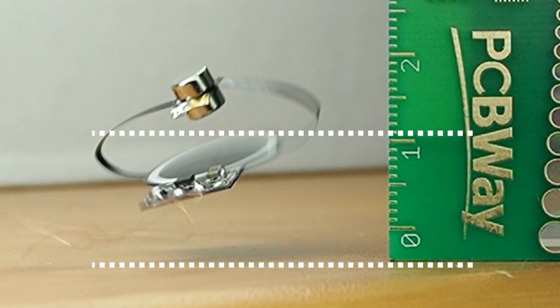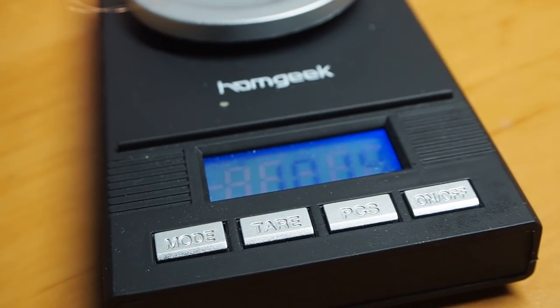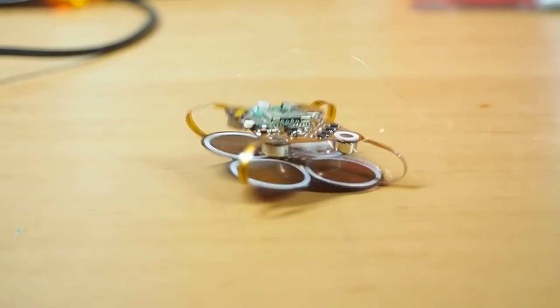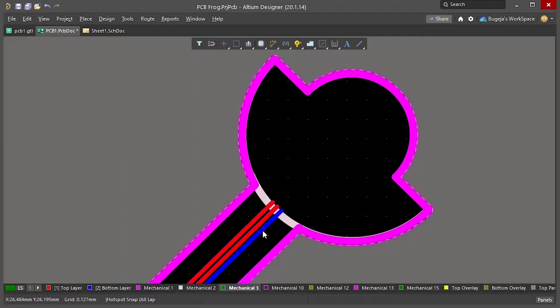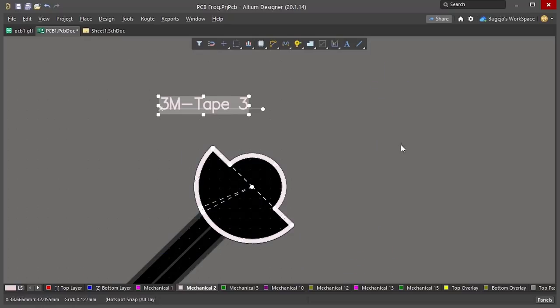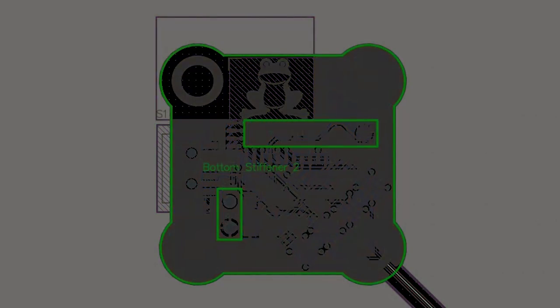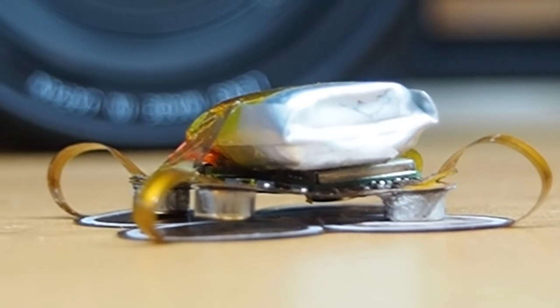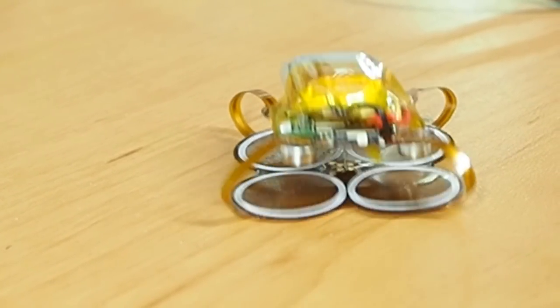I really thought it was going to jump at least one centimeter high. The first prototype managed to jump higher than 15 mm, but obviously that's without the battery. The second prototype is much heavier and also has a larger footprint. I think the mass can be further reduced by eliminating the bottom stiffener, reducing the length of the flexible arms to make them more springy, passing two tracks per arm instead of eight, removing the 3M tape to solder them directly. I also need to improve the mechanical robustness — that whole region got bent by the end of testing. Unfortunately I didn't arrive at phase 3 to test directional control, as it's useless to test it given that the robot isn't jumping that high.